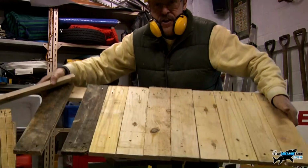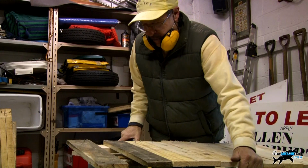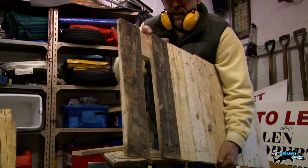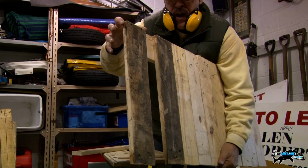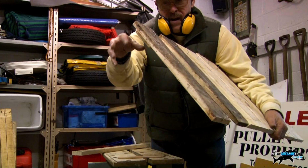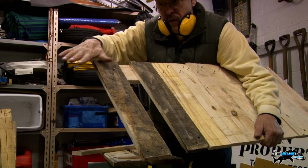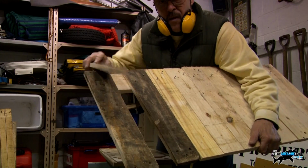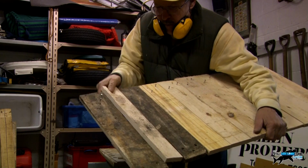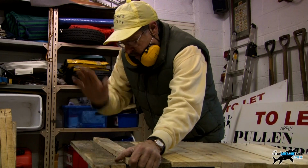Okay, there's the first section of one side of the roof done, but obviously you have to get the measurements there and thereabouts. Being with the width of these, they don't come just over. I don't want to leave a huge amount over the edge for the overlap at the front, in other words to stop the rain coming down, so it's weak on the nails. So I've put a good wide board on the outside as the overhang, and then measured and cut a fillet of wood which drops in there, either way up. Just drops into the gap, give it a bang because I've got it nice and tight.